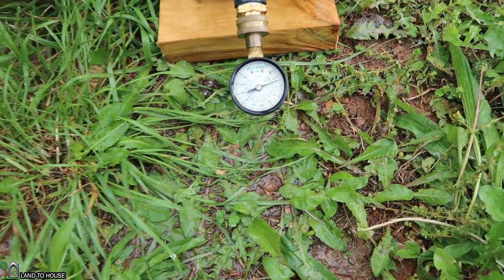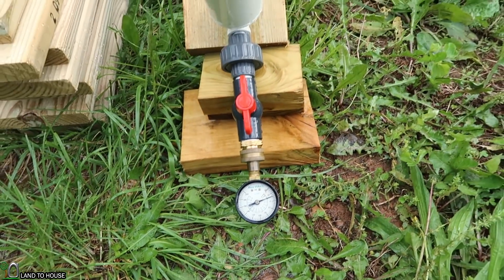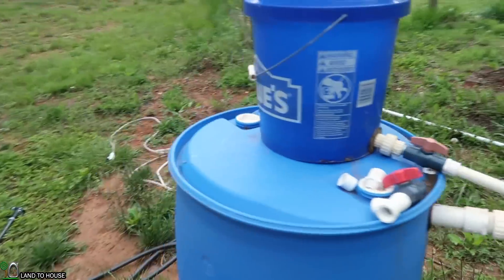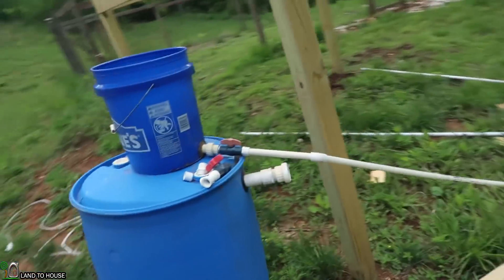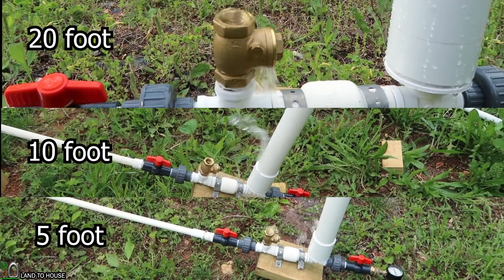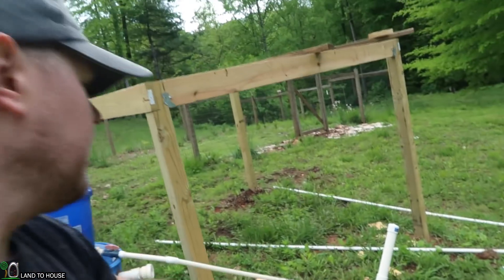Let's see what our pressure is down here. Looks like 24 — no, 26. So significantly less pressure, almost half of the longer pipes. Let's check out the amount of water used. It is even more than with the 10-foot pipe, so it is definitely consuming more water. Those tests are pretty conclusive. Will the pump run on a very short drive pipe? Yes, it will. Five feet is as short as I've ever tested, and it worked. But with the PSI drop of over half compared to the longer pipes, it's highly inefficient and uses a lot more water.